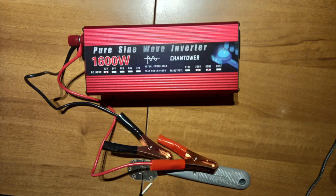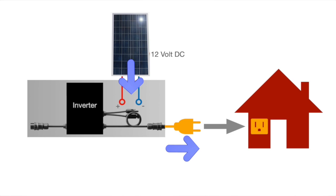Normal inverters power just one outlet. The micro-inverters feed into the whole house, helping all devices. Even if two panels give only 500 watts, it will reduce the power that you buy from the grid. For example, your washing machine pulling 2000 watts — your solar cuts that down to 1500. Clean. Clever savings.